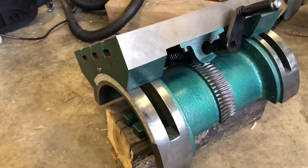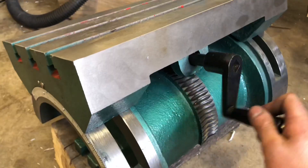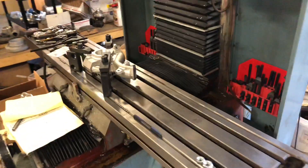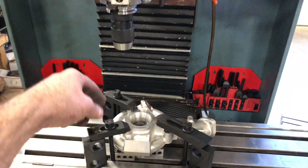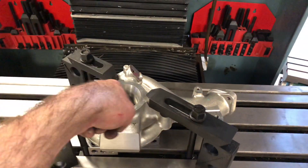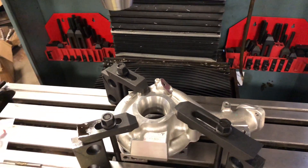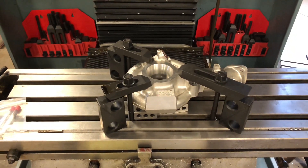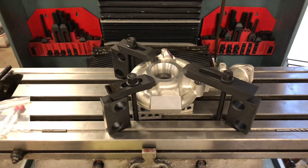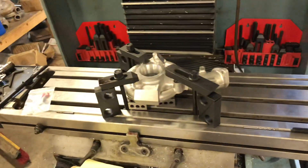You can see my point here of how to do this job. It works the same with that Camaro turbine housing. That angled plate fixture can mount directly to this table. Then you could use the mill to put your tools in there, be able to do a circular interpolation to bore out the inducer. Then you're going to have to cut for the radius — you could have a special radius tool made, or use a ball end mill if it'll fit. You'd have to use CAD software to do the radius part. Here we go.